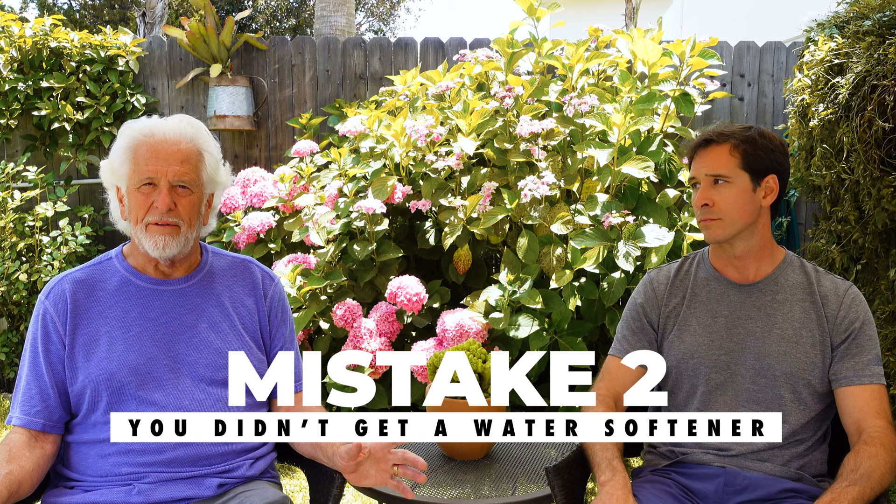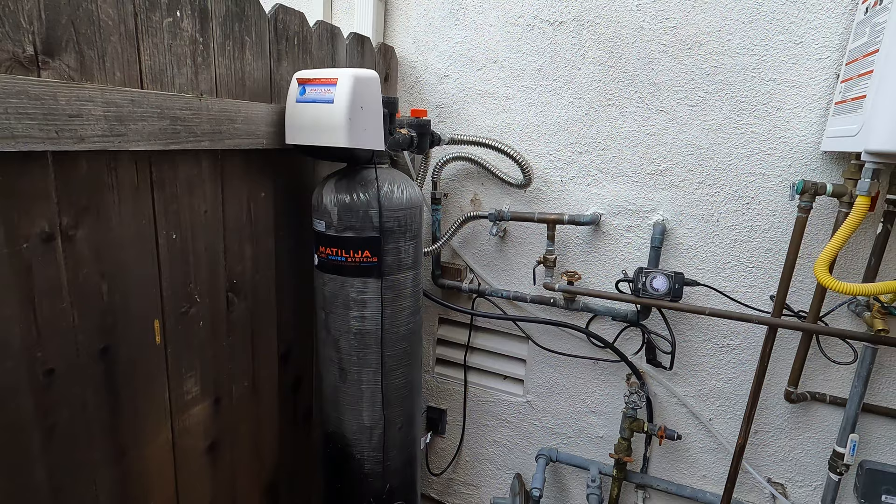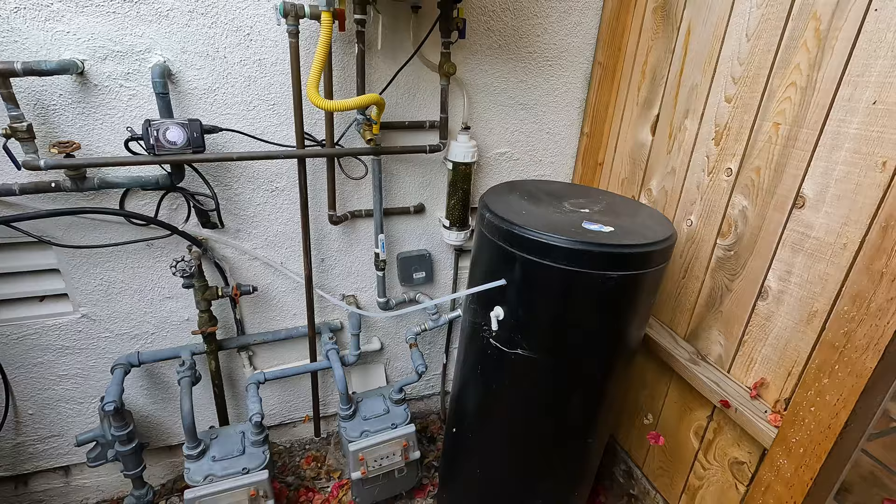Number two: I always feel you've got to have a water softener. They sell a filter, but why not soften all the water in your house? If your city water is already below the hardness level, you're pretty good, but you should still add a filter. A good, large softener can take hardness right down to zero, and that's great for the on-demand heater — it helps prevent liming up on the inside, stops calcium and magnesium from building up inside the heat exchanger.